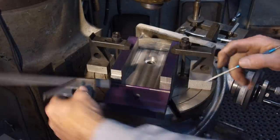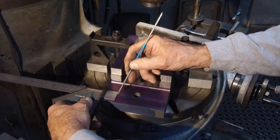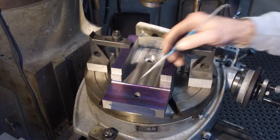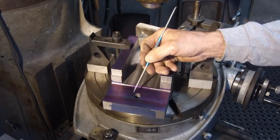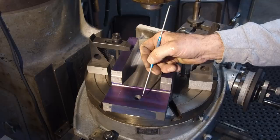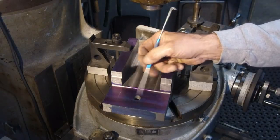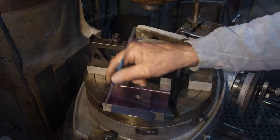a 1-inch line here and a 1-inch there. Okay, I'm gonna come in here with a turbo end mill, probably half an inch, because it doesn't create a lot of tool pressure, and we can hog out that material. So we'll go ahead and we'll sweep that back and forth there, and then we'll drop down on the outside here and we'll take off this shape right.